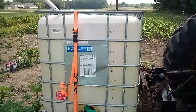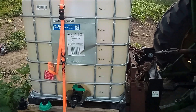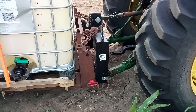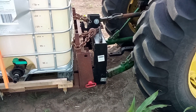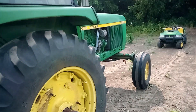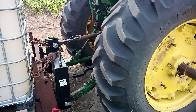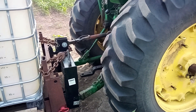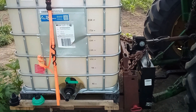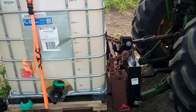When this is full of water — which it is right now — it weighs 2,200 pounds plus, so you need a pretty hefty tractor to move it, let alone pick it up. This John Deere 4230 has no front end weights, but it's got massive rear tires — 18 and a half inches wide. It handles this with absolutely no problem, though it does get a little light in the front end going up a grade.